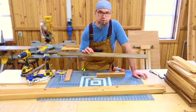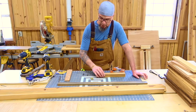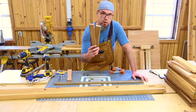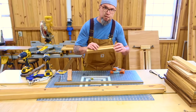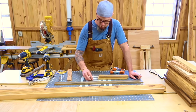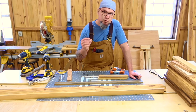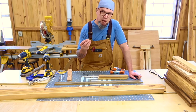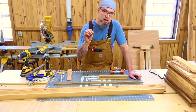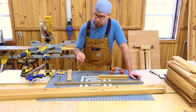You're going to need five boards that are 72 inches long, inch and a half by five-eighths. You're going to need one board that is 34 inches long, same dimension as everything else. Any wood I mention will be the inch and a half by five-eighths. You will need two boards that are 12 inches long — these are going to be the bottoms of our trellis. For hardware, you're going to need one and a quarter inch deck screws, which will not rust like regular wood screws. I like to use the star head deck screws.